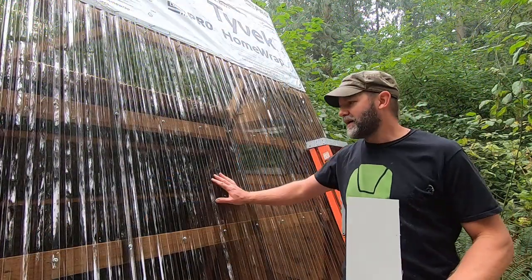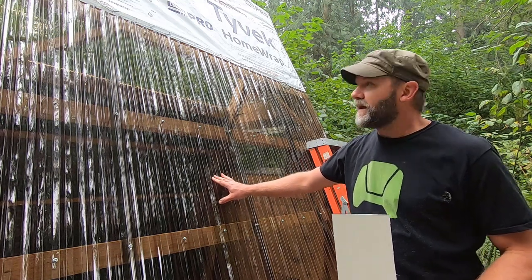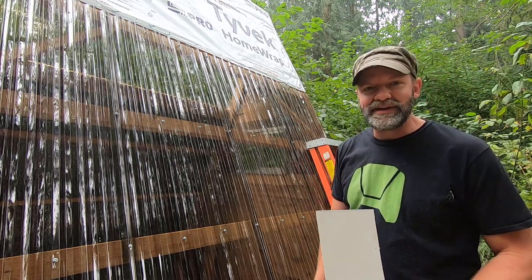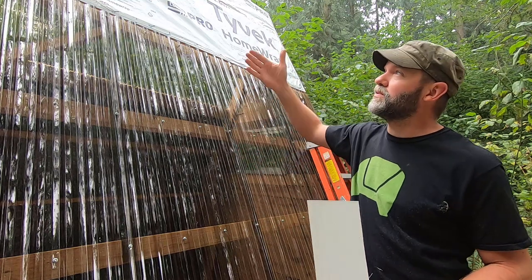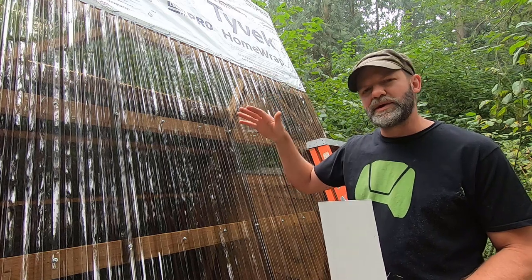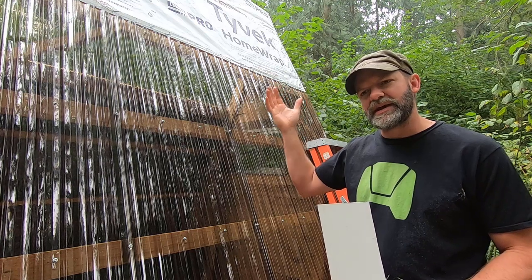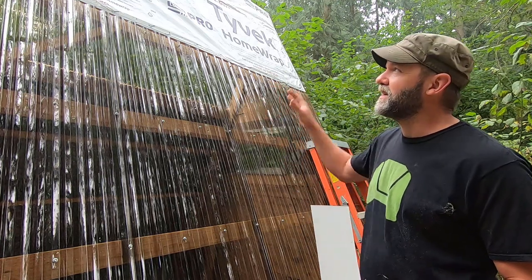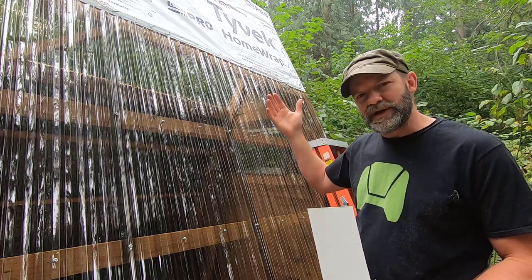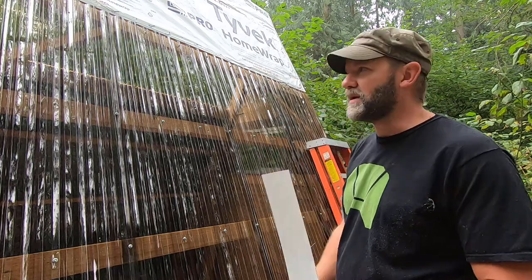All right, so this paneling went on pretty well, and I did some of the Tyvek home wrap. I was picturing, so I'm putting a metal roof on, and I've noticed in some of my other barns, at least the ones that are exposed metal roof, in the winter time that gets cold and you get condensation on that, and it kind of drips down. So I thought maybe this would help from some of that condensation forming in the first place, and then what does form maybe has a tendency to kind of run off and not seep into the wood.